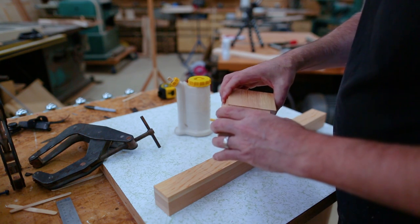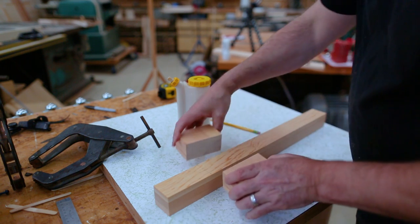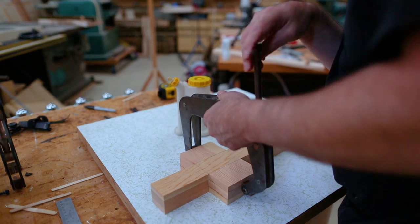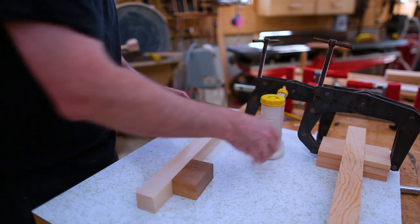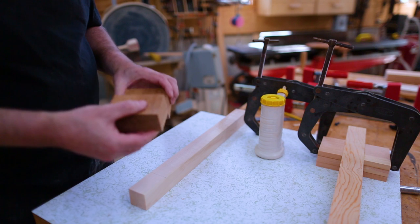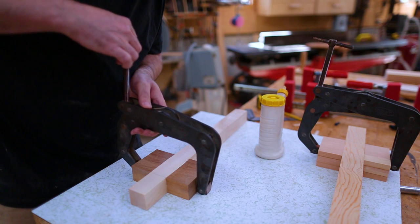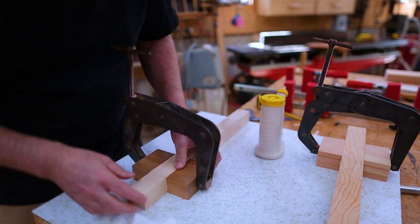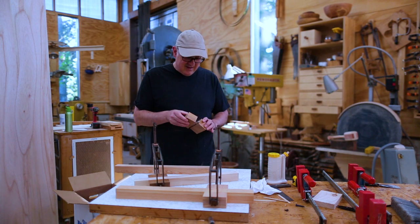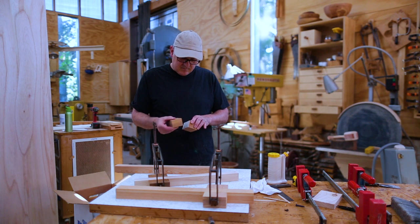Once I had all my parts made I could start assembling mallets. I ended up making three at this point. One is all fir — the fir mallet going together, gluing the two sides of the head on. With this round I was thinking about putting some weight in the head — ball bearings — and cutting holes for that on the CNC. One mallet has a maple handle with a really hard, heavy, dense tropical hardwood head — from the same board I used to make the original mallet years ago.